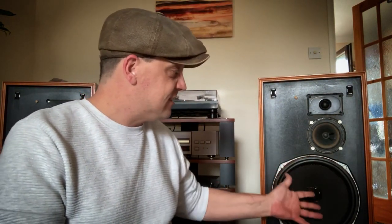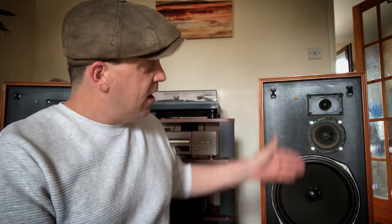Let's have a closer look. 12-inch outwardly rolled rubber surround — this is that Celestion unit. Now it's not uncommon for Celestion to provide drive units for other manufacturers. Things like the Celestion HF1300 have been in a number of loudspeakers over the years, the Celestion HF2000 as well, and the MD or MF500 mid-range driver has been in various other speakers, other than Celestion's own.